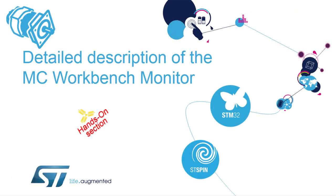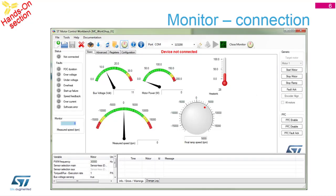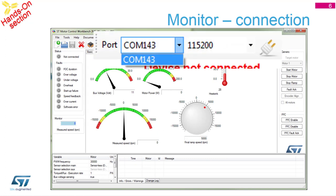For a detailed description of the Motor Control Monitor, you can follow along. The previous project was created with TrueSTUDIO - you can run TrueSTUDIO, or since the software is already on the microcontroller, go straight to the workbench. Please open the Motor Control Monitor. When you open the project in the workbench, you see the main view, and there is a button to open the monitor. The next step is to connect to the board - choose your COM port and 115200 for the baud rate, and click the wall adapter icon to connect.